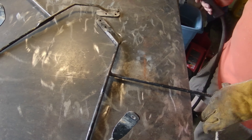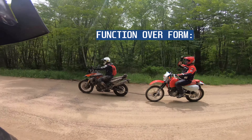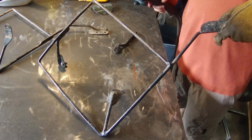So if you're using gas-shielded welding you don't have to do this, but with flux core, once you stop welding you've got to clean that slag off or it'll get in the weld. Of course, that's bubbling the paint off because we didn't bother cleaning any of that stuff. Function over form. But those have been through quite a lot — they just get beat to hell when he rides. They held up very well for two years, which is surprising.